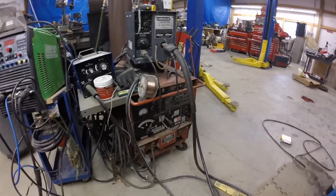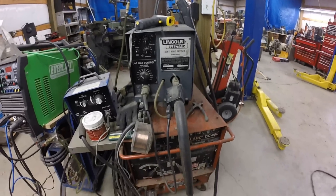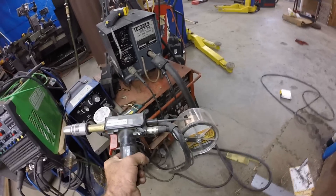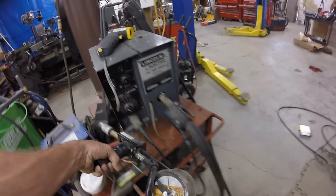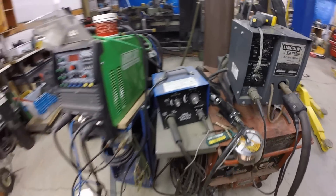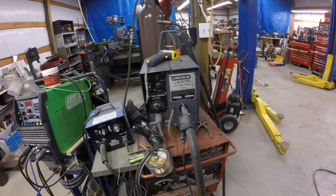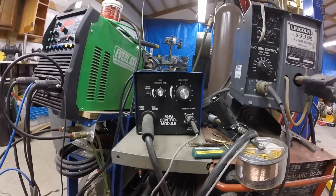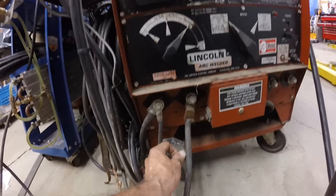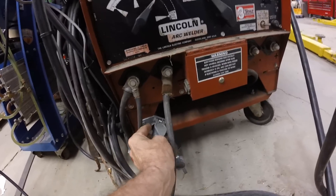This here is my preferred go-to welder — a Lincoln Idealarc DC 250. It's got a Lincoln LN-7 wire feeder on it, and I also have a spool gun for it. I generally use the spool gun for MIG welding aluminum, because aluminum doesn't push well through the long six-foot conduit on the large wire feeder. I have a wire speed control for the spool gun, and I set them up with a trailer plug so when I want to switch wire feeders I just swap the plugs.